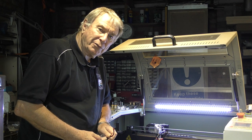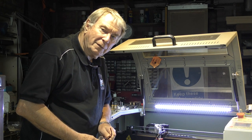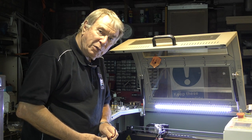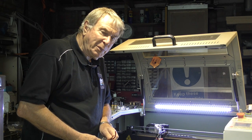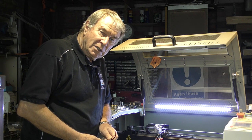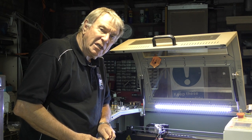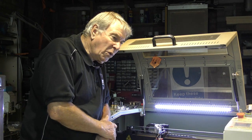I checked back and it was about 3 years ago that I started investigating the cutting properties of some 1.5-inch lenses that I had in my collection. Now, I'd done my reading about energy density and spot sizes, and I was promised that 70 watts into a very, very small spot size would produce a very, very high energy density, and that would be great for cutting. So, really what I was trying to do was to find out which of the few types of lenses that I had, meniscus, PVD, CVD, whether I use them upside down or the normal way, which would be most efficient